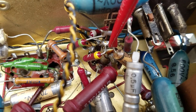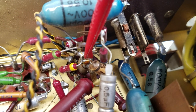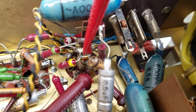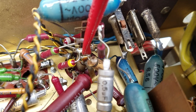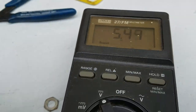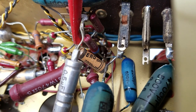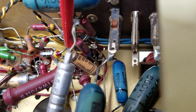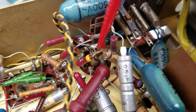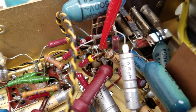I believe that one right there is the coupling capacitor — that's what couples the audio to the grid of the output tube. This tube has both the audio preamp and audio output in it, it's a dual-section tube, and it has 5 volts on it. That little brown ERO 100, looks like 2200 picofarads, is leaking. I got 5.8 volts there.